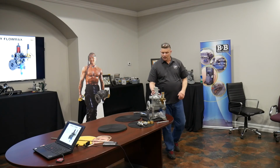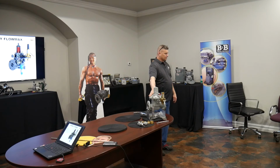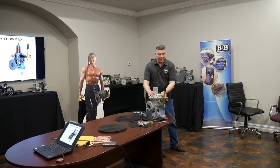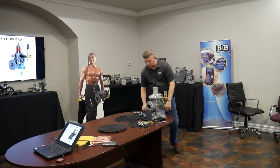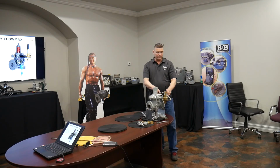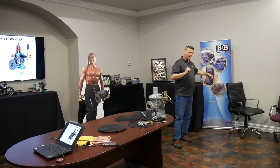So, Jeff, can I ask you, just to clarify, if you're running the dump line downstream, it's between the regulators? Between the two regulators. And in fact, this is why we're doing it, because if we do it by the Mooney IOM manual way, and it's hooked up just like I've described, this is the upstream regulator. The pilot is actually getting sense pressure through this upper chamber above the diaphragm. The sense line's being run downstream of the second regulator.